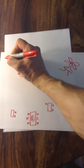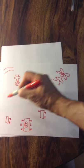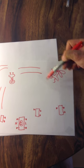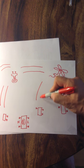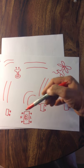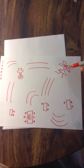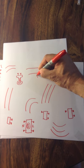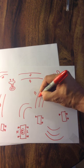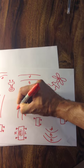It's going to get pulled from the source here. We're going to get source power with 14/2 going that way, and 14/2 switch line going to the light to control it. We're going to jump the power into the outlet housing the fan, bring down a 14/3 to this switch, transport power over to this receptacle, and run 14/3 to control the fan. So if you're going to list the conductors: black, white, white, black, black, white, red, black, white, white, black, red, and black and white there.